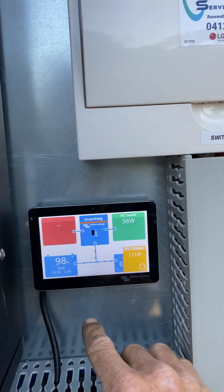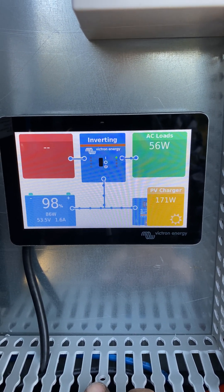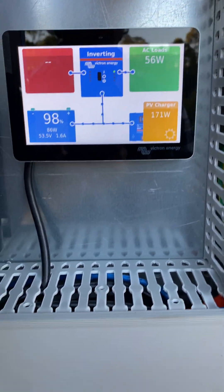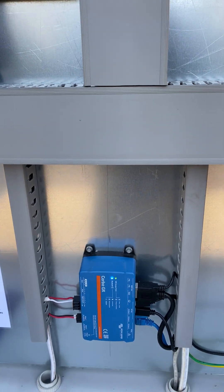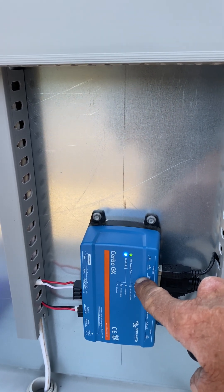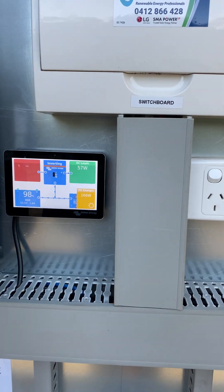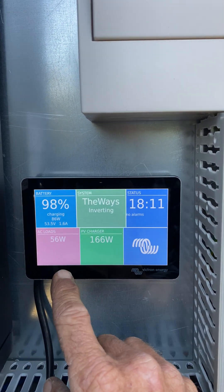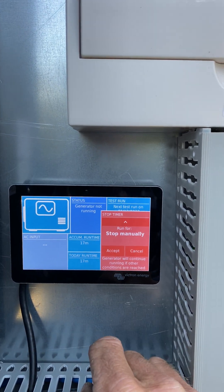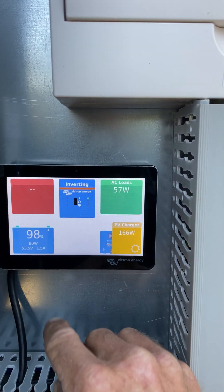This is our colour screen here so you can see everything that's happening. You can also see this display on your phone or from a laptop or PC via Victron VRM, which is their portal. This is the Cerbo GX device — this will connect to their Wi-Fi network and then they'll be able to see the system from wherever they are in the world with an internet connection. There are three screens on there, and I can actually manually start the generator from here as well if I want to.